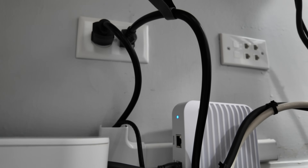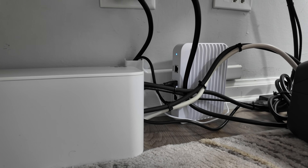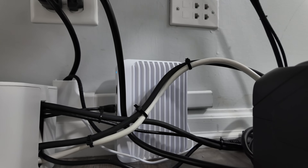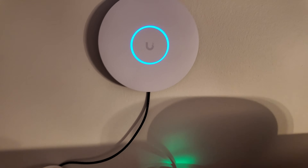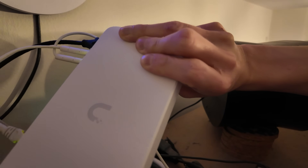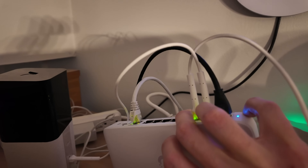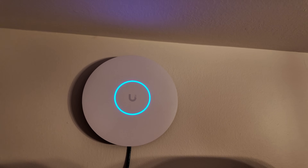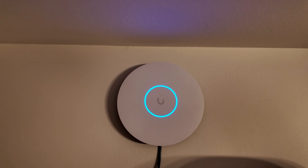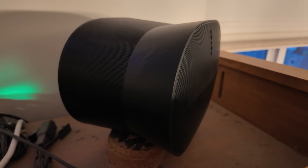In my office I have a 4-port UniFi switch with 10-gigabit Ethernet going mainly to my laptop, but I like having that option to plug in more stuff over time. In my dining room, there's another Wi-Fi 7 access point from Ubiquiti, plus a USW Flex 2.5G switch. I'm running CAT 6A up there to get 2.5-gigabit Ethernet to that switch, which connects smart home hubs and my Abode security system, as well as providing a 2.5-gigabit uplink to the new Wi-Fi access point. I also have a Sonos ERA 300 up here — really underrated speaker.